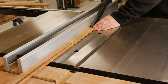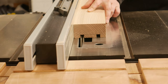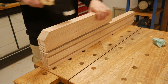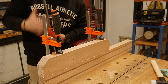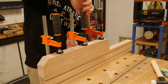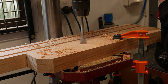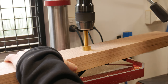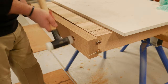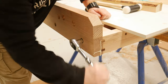I am hoping this will help reduce any cupping or warping of the bench top. One of the end caps needed to be extended to suit the vice. The vice holes were drilled, a recess was put in to suit the lag bolts, the end cap and splines were glued up, and because it was end grain, lag bolts were put in. Then the ends flushed.